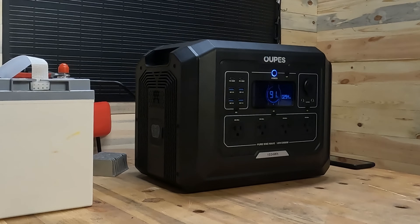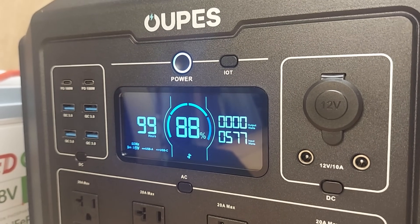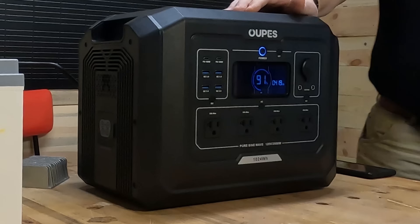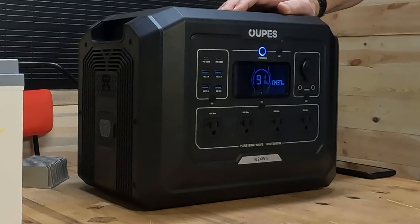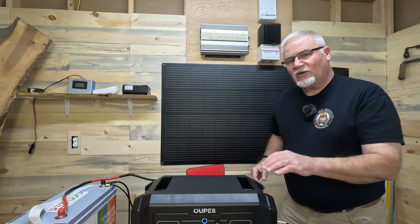In my initial testing — from the video that I lost the sound on — we got up to 579 watts. I was quite surprised by that because my step-up converter is rated at 10 amps, meaning I should only get 480 watts out of it. However, perhaps because the Opus Mega One can draw 13 amps, it's allowing a little over the rated output. I did hear the fans come on, though they're pretty quiet. We're now over 400 — 434, then 495 — so we're actually pulling over 10 amps and close to 500 watts out of this battery to charge up the Opus Mega One.